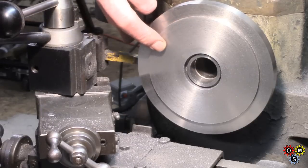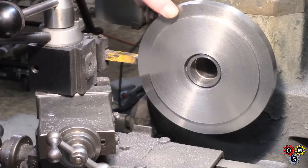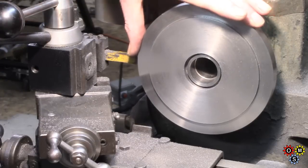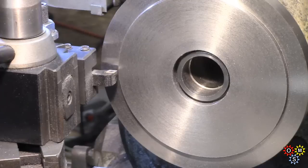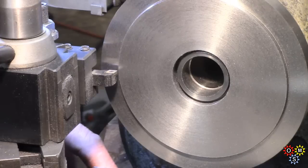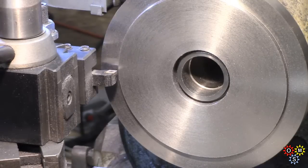I've taken a light cut or two. I've basically got to get the register down to probably two or three thou below what's required for the chuck, and get chamfers on the edges. There's so much dust coming off this though, so I don't want to get it on the lens. I've got this register to do now. One of the problems on this old machine working right up here — everything goes a bit tight. I haven't got room for a stop which I normally use, so I'm using a magnetic indicator on the rail. I've got 83 thou to take off, so I'll get part of the way down, then I'll check it.